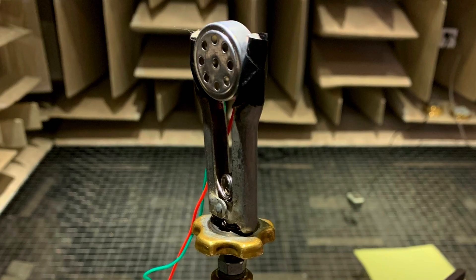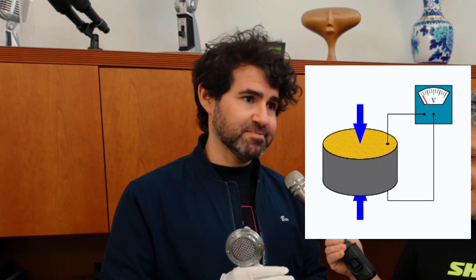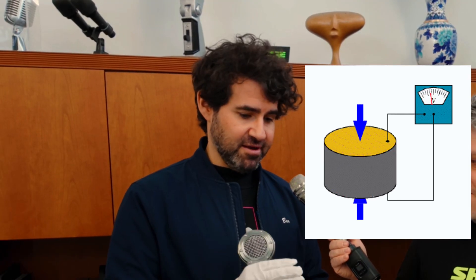And now I have Ben from the Mic Lab here to tell us a little bit about how these crystal microphones work. So a crystal microphone is a type of piezoelectric microphone. Piezo is a class of materials that have this special characteristic where they build up a charge on opposite surfaces when they're deformed or when there's any kind of deflection or strain put on them. Other applications for piezos are like sonar or ultrasound. Basically, it's connected mechanically to the diaphragm, and when the diaphragm moves from the sound pressure waves, it distorts the crystal — putting strain and pressure on it — and that pressure and deformation causes an electric current to flow between both sides of the crystal, the top and the bottom. And that becomes essentially the microphone signal.